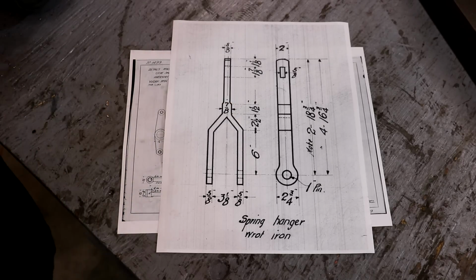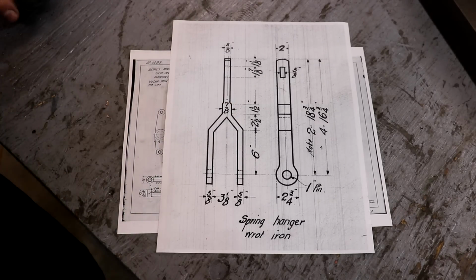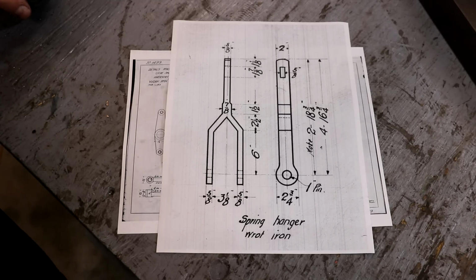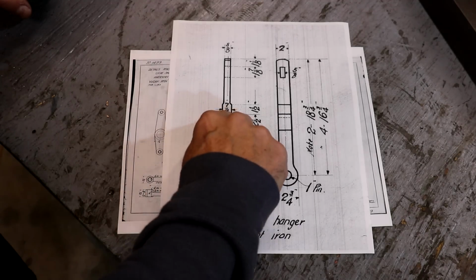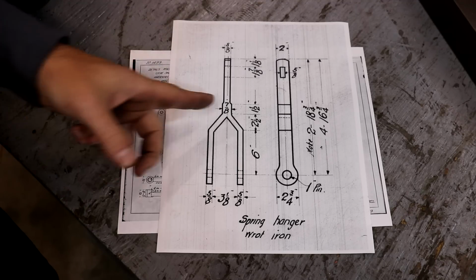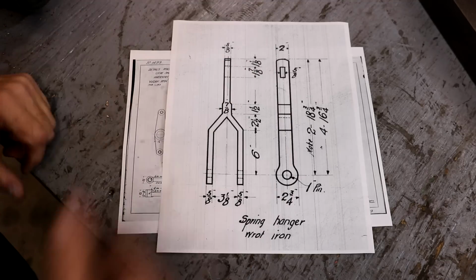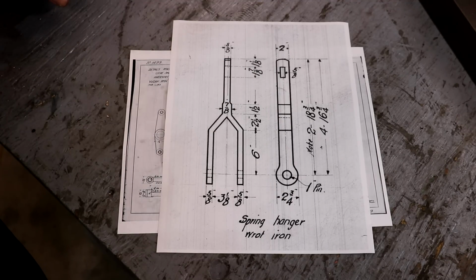One of the beautiful things about wrought iron is while it doesn't weld very well in modern welding techniques, it forge welds beautifully. Forge welds better than steel, so you know that these were originally forge welded. Ours broke right below, in this area, in that little corner. It was not in the weld, which actually held just fine. It was just outside the weld, and probably just from the stress and the rocking over the years, it eventually got a weak spot there and broke.